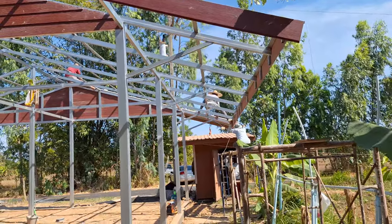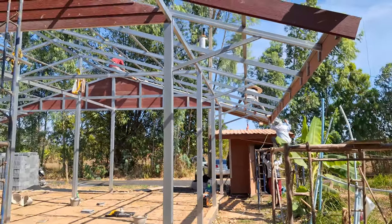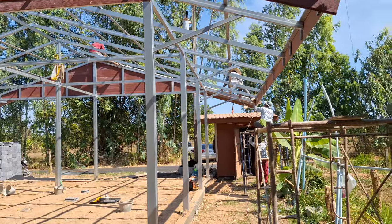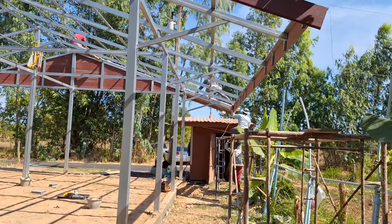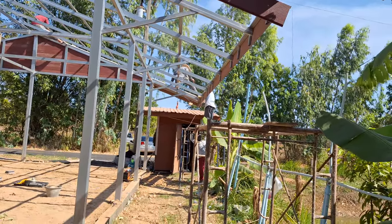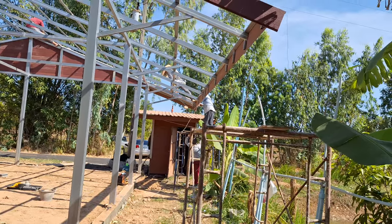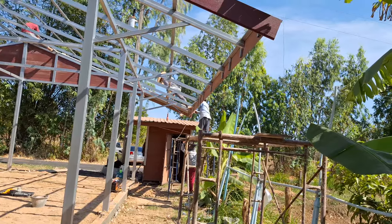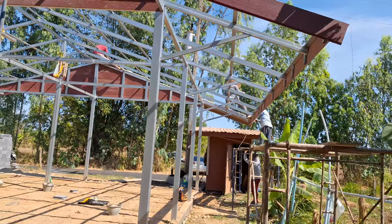And I think the spacing of, what do you call them, purlins? Those ones, yeah. Looks to be about 600, which is an industry standard. So, from memory, 450 and 600 are the two widths, depending on the purpose of the roof and what it's been coated in, or covered in. Isn't that about right? That's what I've come to see over the years. They tend to be the two regular sizings I see.